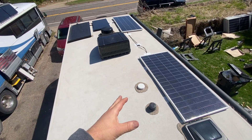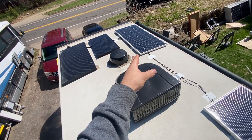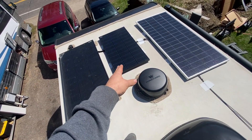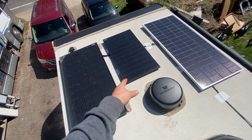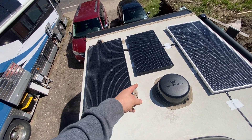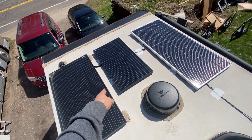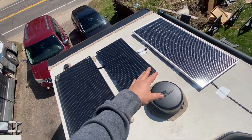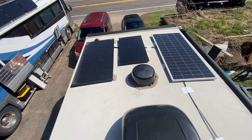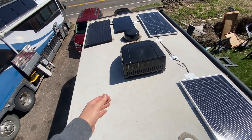Up on top here, we've got the stock 165 watt Furion panel, a 200 watt Rich Solar, another 200 watt Rich Solar, and to make it all work we paired that with a 100 watt Spartan solar panel. We're finding we're sistering a little 100 watt panel with these pretty often and it's working out good. The reason we do that is to get the voltage of those two panels up to the same voltage that the others are working at, and then we ran all three groups in parallel — that's a group, that's a group, that's a group. We ended up with 665 watts of solar up here using the same battery. Not bad.